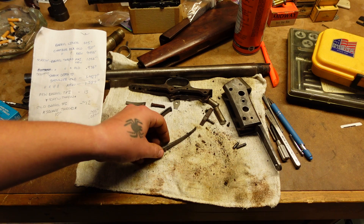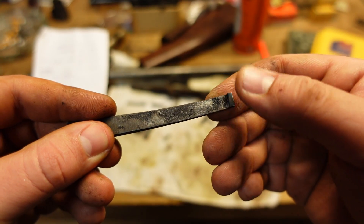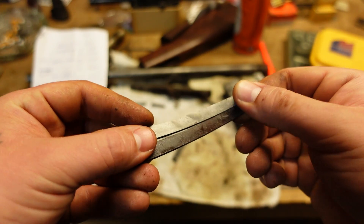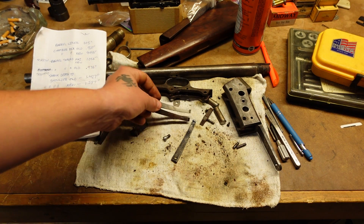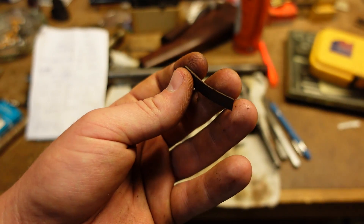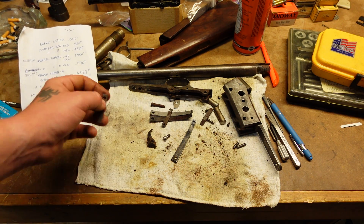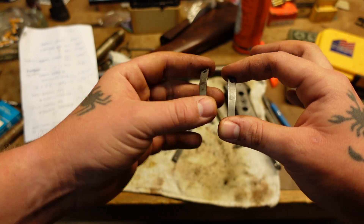The main spring came out — this is the main spring that was in the trigger guard. You can see there's that little tab up at the front that's been ground down. Here are the replacement springs, and you can see that tab is there — this is what keeps pressure on the actual hammer, keeps it at half-cock. The trigger spring was also pulled out; it's pretty corroded and worse for wear, with a layer of gunk and corrosion. But no big deal — we've got replacements. Luckily, the trigger and block locking lever springs are the exact same.